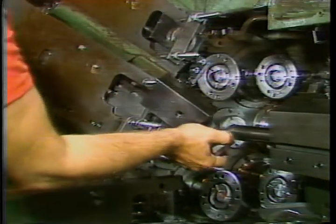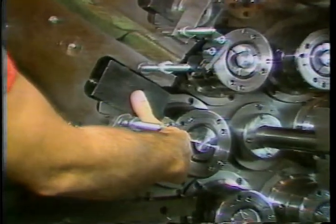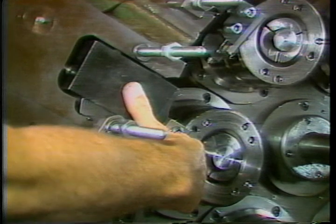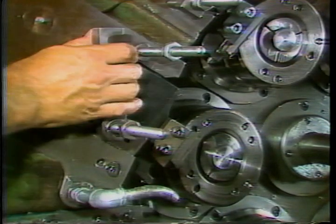You will be responsible for resetting the positive stop tension on cross slides that produce the final dimensions of a part. The form tool and holder must be mounted to the cross slide. Be sure the tool holder is back far enough to ensure the tool will not cut back off the positive stop screw.